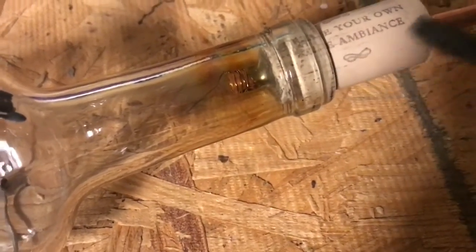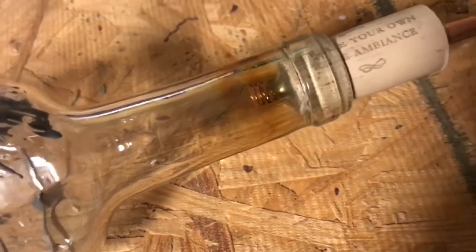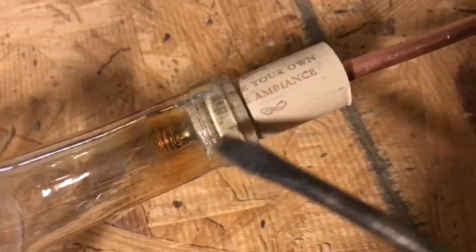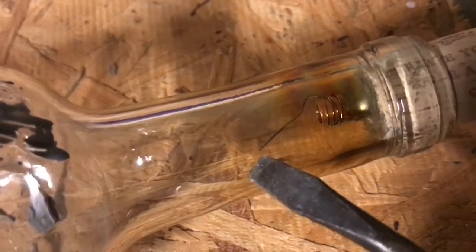Getting a cork, drilling a hole through it, filling the hole with epoxy and then poking a copper tube down the bore of the tube. Then I've got a small amount of nichrome wire which I've coiled around the top of the piece of copper tubing so it's like a cold cathode.